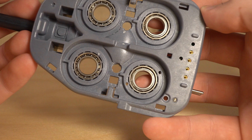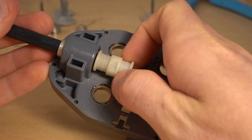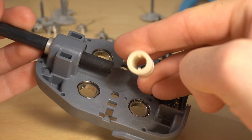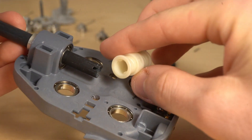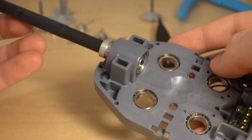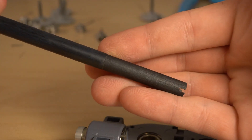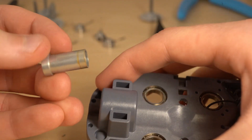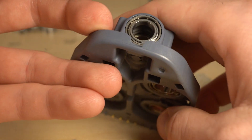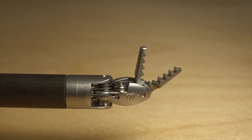Here are all the bearings with everything removed. The last step is to remove the shaft. The plastic drive pulley is just a slip fit with keying features to transmit torque to the shaft. The shaft is also a slip fit in the bearings with an aluminum liner, and there's a small step on the shaft to hold it in place axially. The bearings are press fit into the plastic part. That's all for now - let me know if you have any questions in the comment section, and I will see you next time.